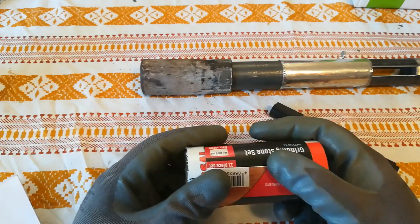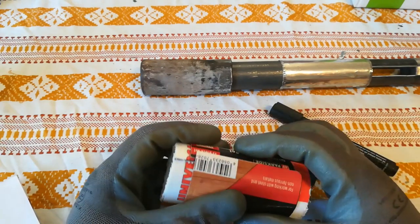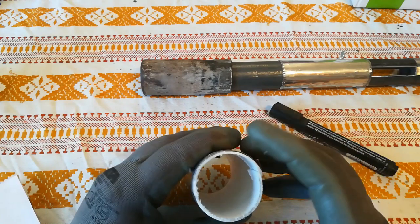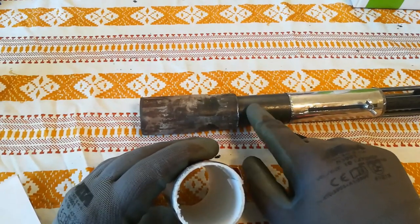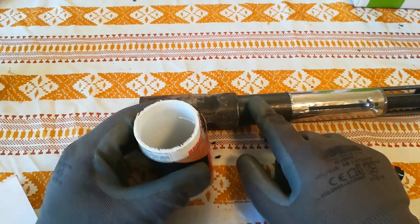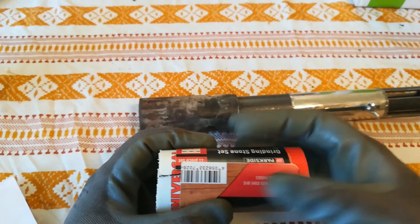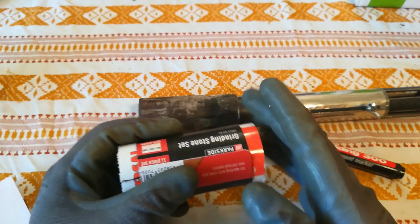If you can find stainless steel pipe, by all means go for it. Or even better, if you have a lathe you can build this nozzle out of solid thick stock. The important thing is that the inner diameter is at least 10 millimeters bigger than the nominal inside diameter of the main body pipe. So if this is 25.4mm or one inch inside diameter, you'd want 35 millimeters as your expanding chamber — that's how venturi burners work.